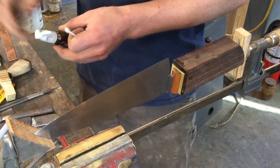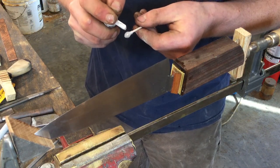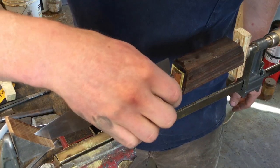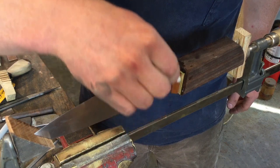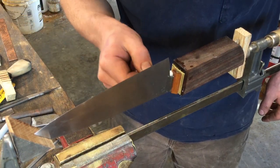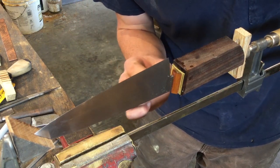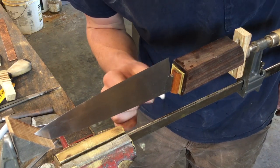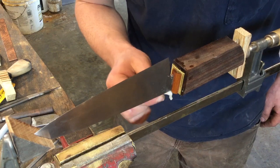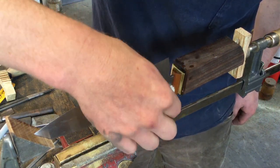So to make sure you've gotten all the epoxy, solvents are a popular way to clean it up, but I actually prefer to just use a little oil. I use a little mineral oil, and any surface that the oil sticks to, the epoxy won't stick to, so it cleans it up just fine, and it won't wick into joints like acetone or alcohol might.